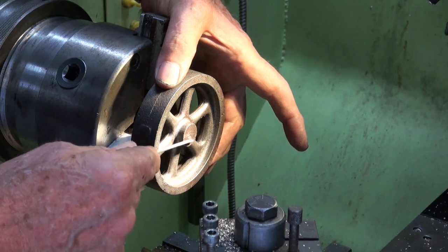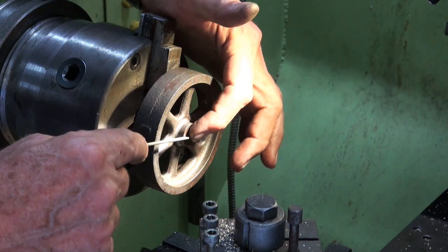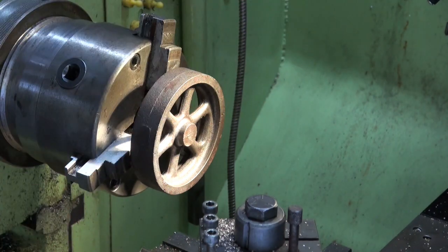If it's going to move, I want it to move while I'm doing these features here. That way I've got room to correct it. Once you drill and ream that bore, everything else sort of rides on how accurate that is. So let's give it a go.